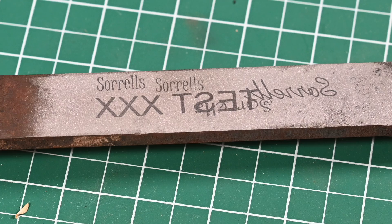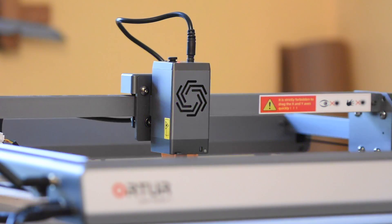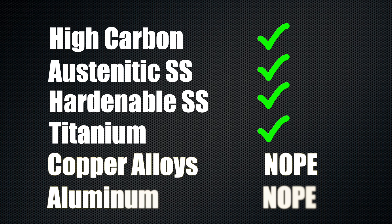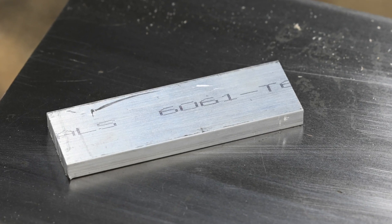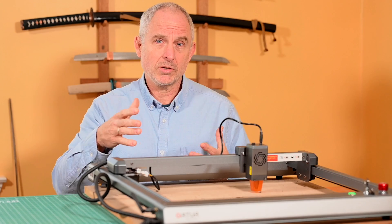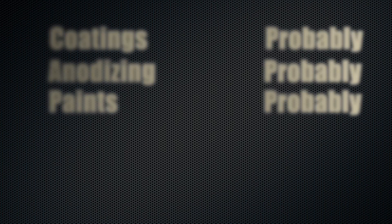I can't tell you I've tested this on every kind of steel, and I haven't tested it on mirror-polished steel, but everything I did test it on worked great. Just be aware — your results may vary. Titanium? Check, not a problem at all. Copper? Nope. Brass? Nope. Aluminum? Nope. This seems counterintuitive — it works on macho stuff like steel and titanium, but not on soft metals. I presume this is because these softer metals have much higher thermal conductivity than steel or titanium, so the heat dissipates just as quickly as the laser can hit it. As for titanium or aluminum anodizing, or epoxy-based coatings like Cerakote or paint — I didn't have time to test these, but I've seen people do them on YouTube with excellent results, so I can't give you any opinion on that.